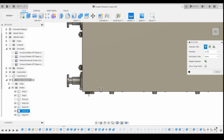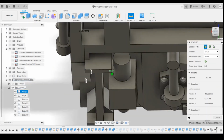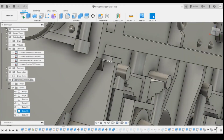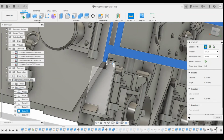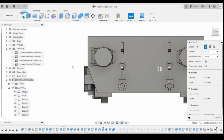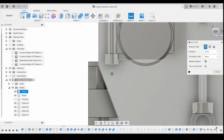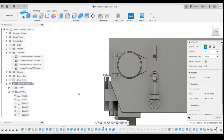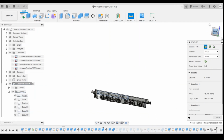If we do inspect there to that edge, maybe how I want it. No, it's not. Close that. If we inspect that edge to that face, we've got 0.5 millimeters sticking out there. If we do the same on this side, inspect there to that face, 0.5, so that's spot on where we wanted it. Okay. So we've now got those jacking points in those four positions here.